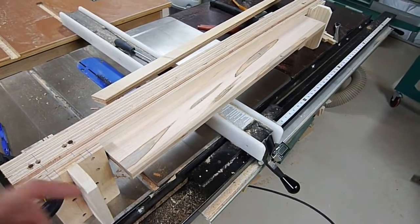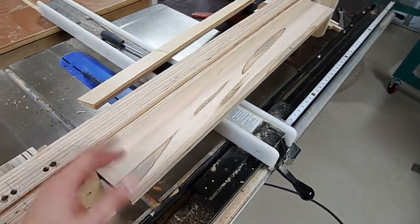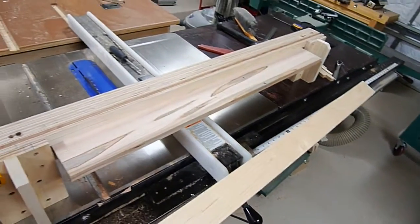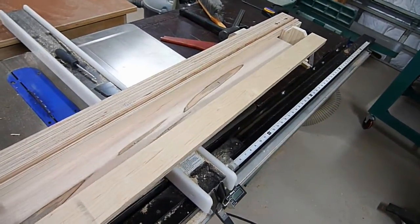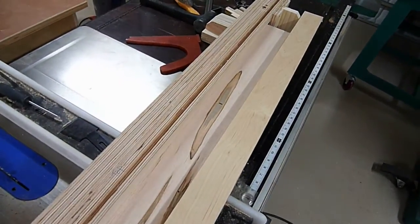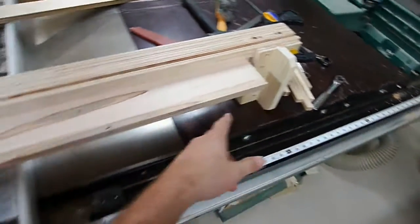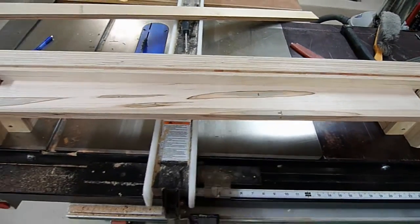The way I'm making this piece so that it does what I need it to — I went ahead and milled this maple, got it in the dado, and got the gantry clamped up. All I'm going to do is take a piece long enough to span both of those ends, lay it flush across here, mark a line down where it sits on top, and cut off the off-side of that line. Then all I've got to do is attach a board from this side all the way to that side, screw it, and set it down — that's going to make it a lot more rigid.